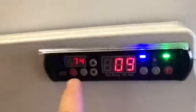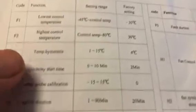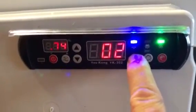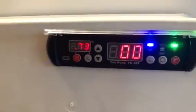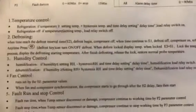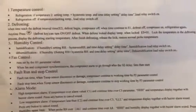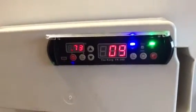The delay start - F4 is two minutes, meaning it takes two minutes to kick in when you switch it on. I want it to kick in straight away, so I'll set F4 to zero. Keep pressing to get to F4, hit set - it's on two minutes, I'm going to make it zero. I don't know why they had that delay, but there it is. That's the concept and principle. This controller is actually working quite nicely and I've been quite happy with it. I hope you enjoyed part two of this tutorial - it completes your setup. Thank you.